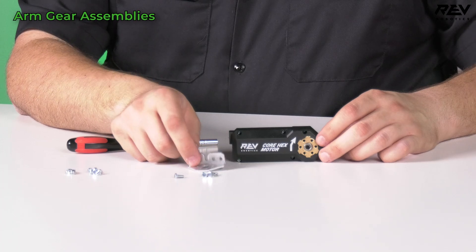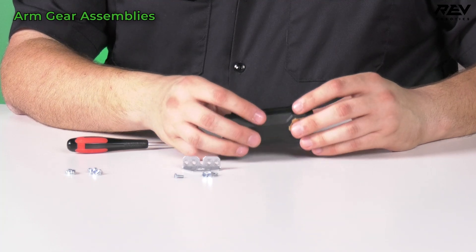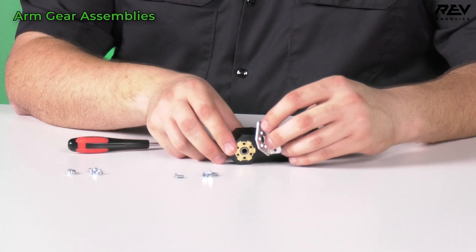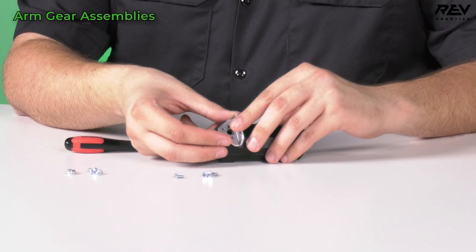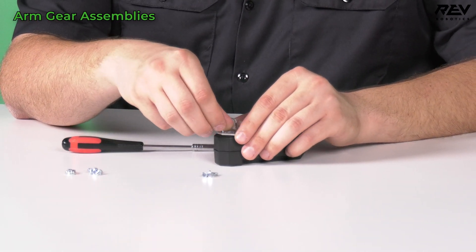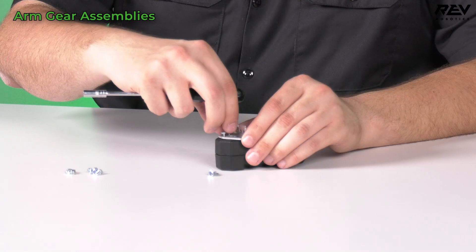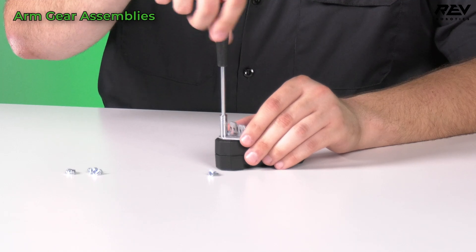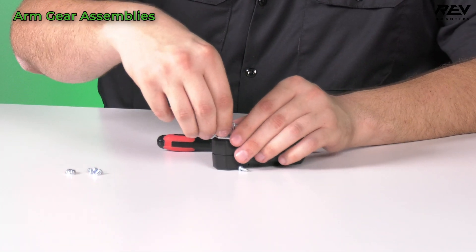That's important because it can be difficult to get to these if it's already preloaded. I'm going to flip the motor over and attach the bracket to this side so that when it gets mounted in the robot, the text is facing out — I always like to try to do that aesthetically. So we're going to take our bracket, line it up with these holes, and get one started. Once we get one started, we go to the next and the next, just starting it — I don't want to tighten these all the way yet, just get all four started first.